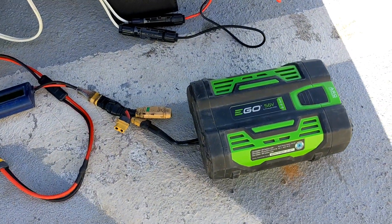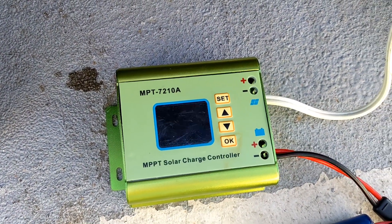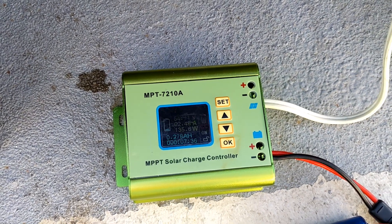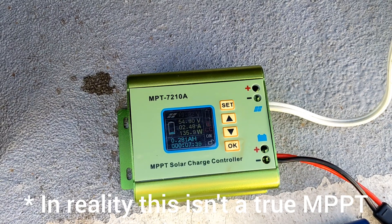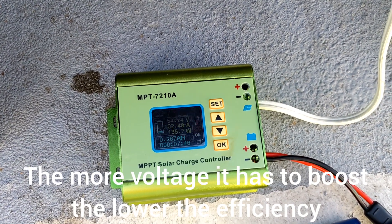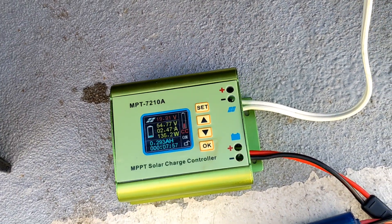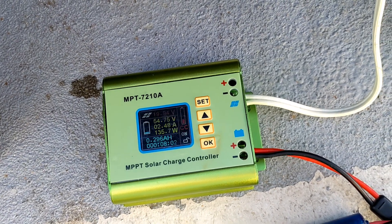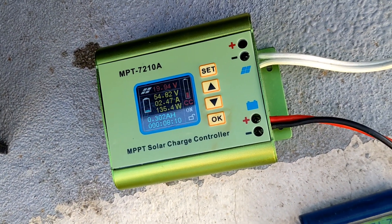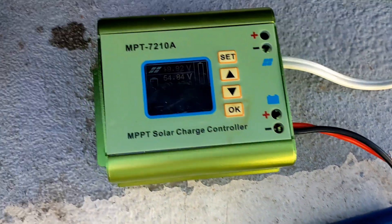Currently charging an EGO battery — 2.5 amp hour — as my test case. I have the MPT-7210A solar charge controller that allows you to boost the voltage from the panels at the maximum power point and charge pretty much any kind of battery, all the way up to 90 volts, which is 21S. It's a constant current, constant voltage charger. It's not very rugged and not meant to be portable, but with some care — especially with the connections here, which I'm thinking of soldering since they tend to come out of the screw terminals — I also have a little meter here to verify the numbers, and they do match up.